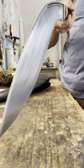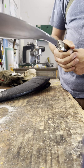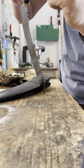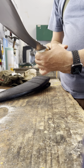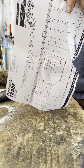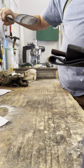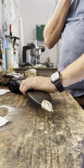The edge it's come with is actually not too bad - it'll take a bit of work to get up to what I consider really sharp, but it's good. It is thin - very thin. The spine on this is thin and the whole thing is gently tapered, a slight distal taper. This is a rat tang - traditional style - you can just see where it's been peened over here, and then a cap has been put on the top to protect the wood. Very traditional rosewood handle.